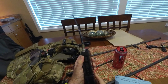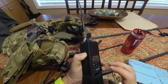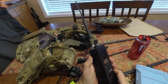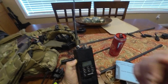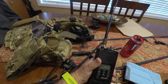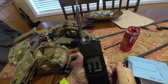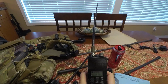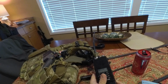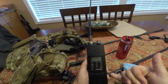It's awesome. So on the MBITR, these are user definable channels. There's a number 1 and a number 2, and you can program them to do different stuff. A lot of units will have these set up so you can push and hold, and it will change you from internal speaker to external speaker, internal audio to external audio. The reason for that is in the event that your hand mic cable gets sheared off in a fight or gets snagged and ripped, and you need to pull this thing out and use it like a walkie-talkie, you don't have to go into the alt menu, mode, up, down arrows, select, enter, nope, not side tone, I want whatever, enter, which is what you would do as a normal grunt with the 148 system. You'd have to go deep down into the menus and then change the audio from internal to external.